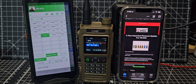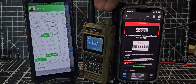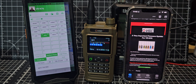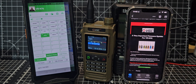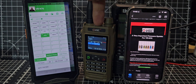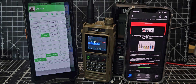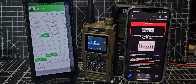I don't know at the moment if this is via the cable you can connect on the side of the N76, or via Bluetooth — I'm going to test it in another video. If it's Bluetooth, I should be able to connect this radio without any other hardware to APRS Droid and other applications. The idea is that this radio picks up APRS traffic from real RF sources in the UK on 144.800, which we're on now, and with that connection — whether Bluetooth or cable — we're good.